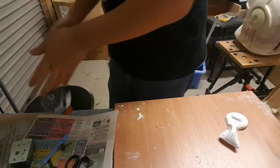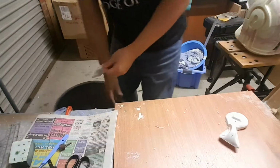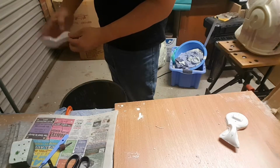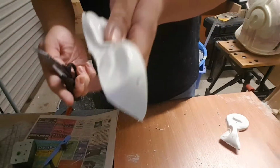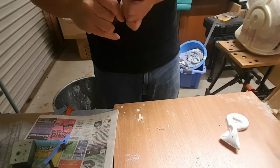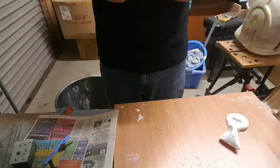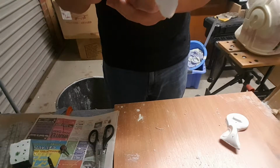Take it off, but check away. Now, because we used the Dremel cutting tool, there's a little bit of burrs around it, so you do need to clean that up. And I'll show you what I do next. So like I said, it's a fairly complex shape around the curve there. So I use the scissors to basically cut it mostly out again. But even the Lexan can cope with all of it. And eventually I actually combine it with a little bit of score and snap as well.